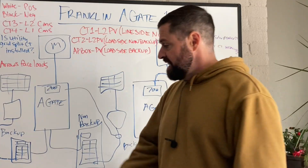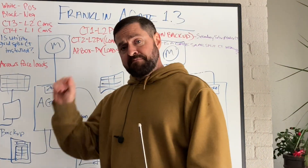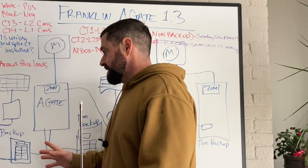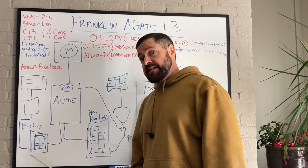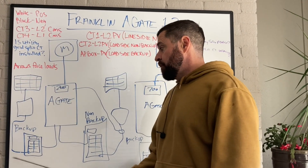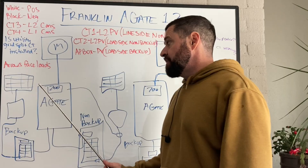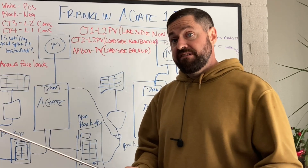What the AP box does is shed that excess PV — it's like flipping a switch to manage that extra PV during an outage so the system works seamlessly. When you use the AP box, it has built-in PV CTs, so you do not need to install any other CTs. Always use the AP box anytime you're utilizing PV that is not installed in the PV port of the A-Gate.